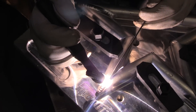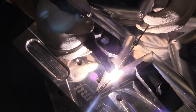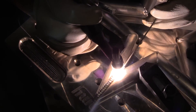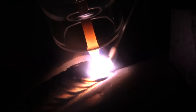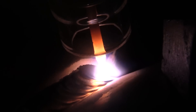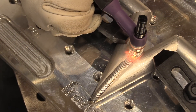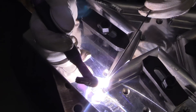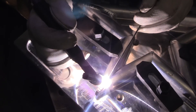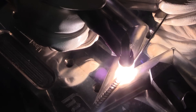Pulsing the pedal really helps when you're going around tubing and trying to change the angle of your torch. I'm rotating the angle of my torch as I come up around that curve, and it gives me a second to keep from overheating everything while I'm waiting to get my filler rod positioned. Through the straight area there's not a lot of electrode angle changing — it's almost like welding flat plate — but around that first bend and going around the corner you have to twist your wrist to maintain a decent electrode angle. Here sped up you can see between each dip I'm rotating my wrist and rotating the torch. Right through the flat area I sometimes didn't pulse the puddle — I just got in a good rhythm and saved the pulsing for areas where I was having to wait a second to reposition the electrode.